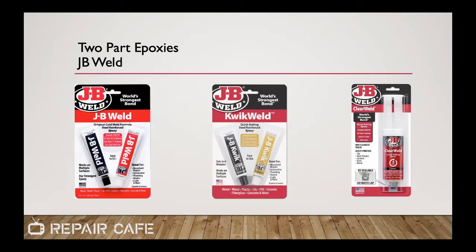So it is a fair question — what about those situations where super glue is not a good choice? Because it's not food safe or not appropriate for the item you're working with. Super glue works really well when you have two surfaces that are perfect matches to each other, like a clean fracture. But sometimes material is missing or you're trying to rejoin something that's been damaged beyond a simple crack — and so then we get into two-part epoxies.